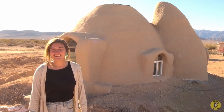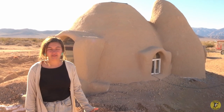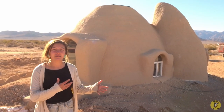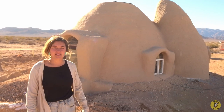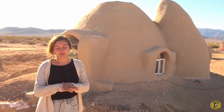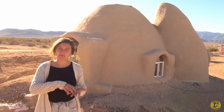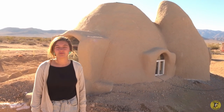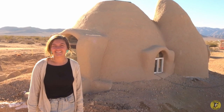This could be a really awesome investment for some people. Cal-Earth has also tested seismic activity and fire resistance — these domes are flame retardant. You can't light the structure on fire; the door will burn because it's wood, but nothing else will because it's dirt, and dirt doesn't burn. For seismic activity, the way they're structurally built with barbed wire between the layers, they basically shimmy on the ground like an upside-down cup on a table. So in California, you can have these fireproof and somewhat seismic-proof domes.